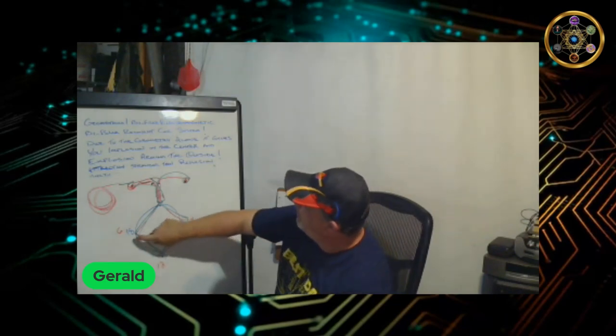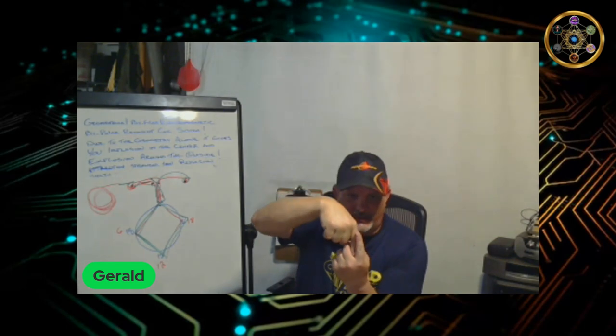Yes. And when you had discussed making your 3D form and you had your post come up and you have your plate come over top. Now, when you wind your wires around, let's say your nails or your posts, the reason why I use a circular screw, a nail, a post, whatever, is so that I can slip a zip tie in there and tie it so that they compress flat. There's a purpose for that. That's why you see my coils.